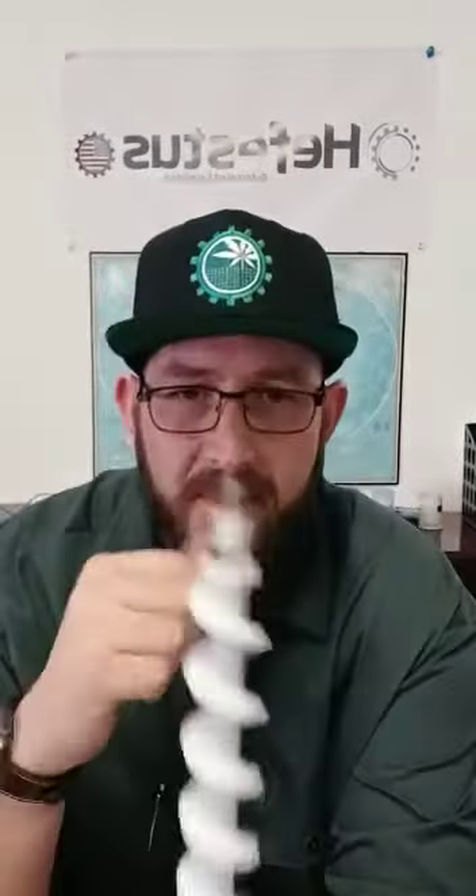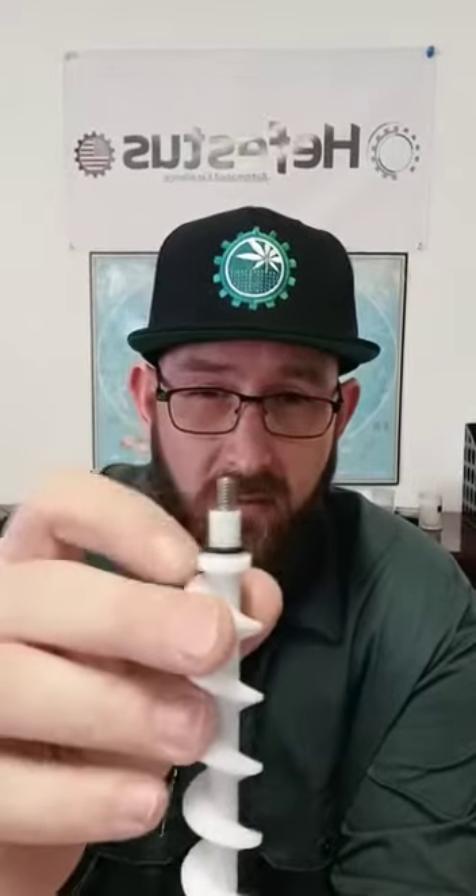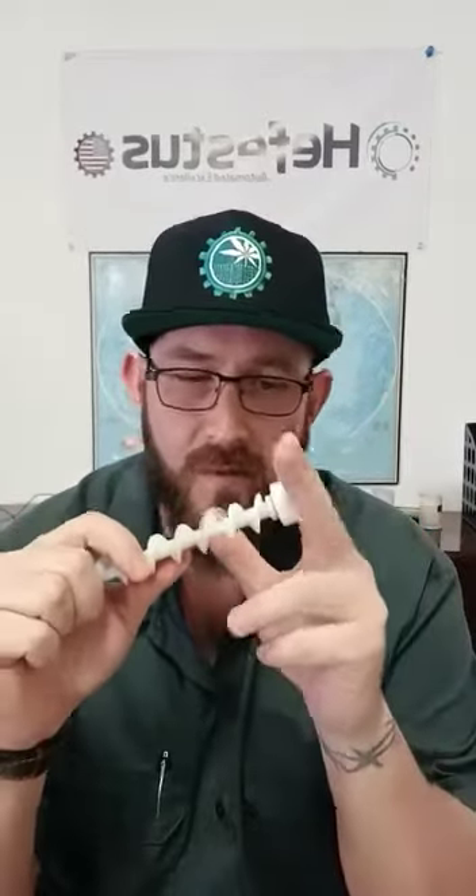Once your o-ring is clean, it is positioned on the auger right here. We'll go ahead and push our retaining cup back over the o-ring onto the auger itself, then use our connecting cap. Remember this is threaded backwards so we'll go to the left to tighten it back up. Everything on this is food grade plastic, but it is still plastic, so we urge you to be careful — don't over-tighten, don't wrench down on it, just hand snug.